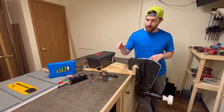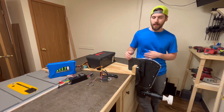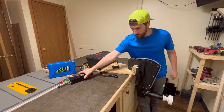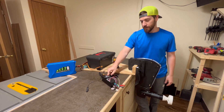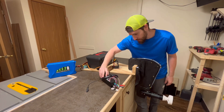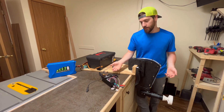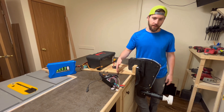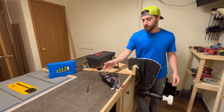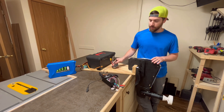So in lieu of that, I'm upgrading my speed controller. I found that if I were to continue with this for the electronic surfboard build, I'm just going to need the power. What we're going to do is upgrade this little guy to this behemoth. This is a FlipSky FSESC 75200 with a water cooling jacket. On the FlipSky website it's commonly called the 75200 — that stands for 75 volts at 200 amps. So this should be able to push a lot of power — way more watt capability into this engine than this little guy ever could.